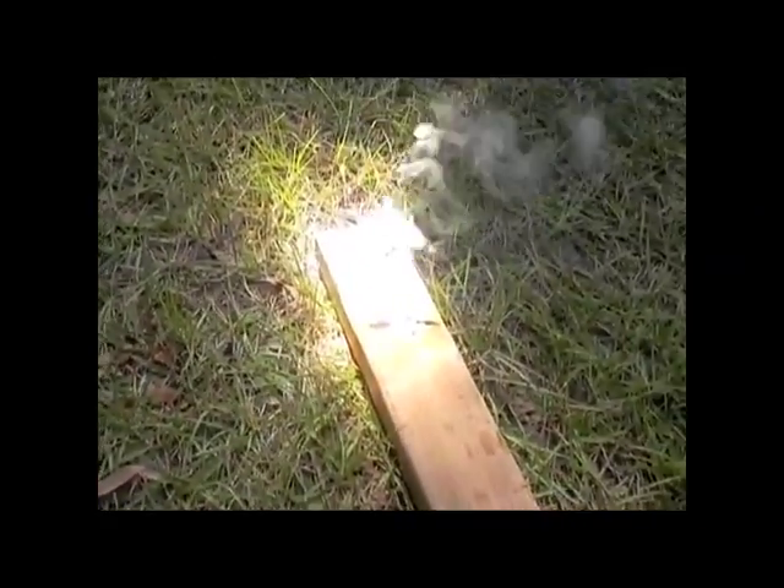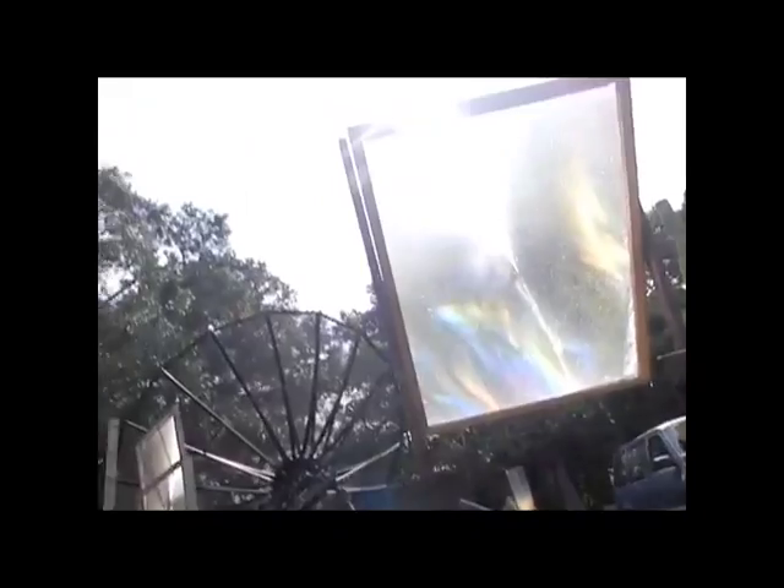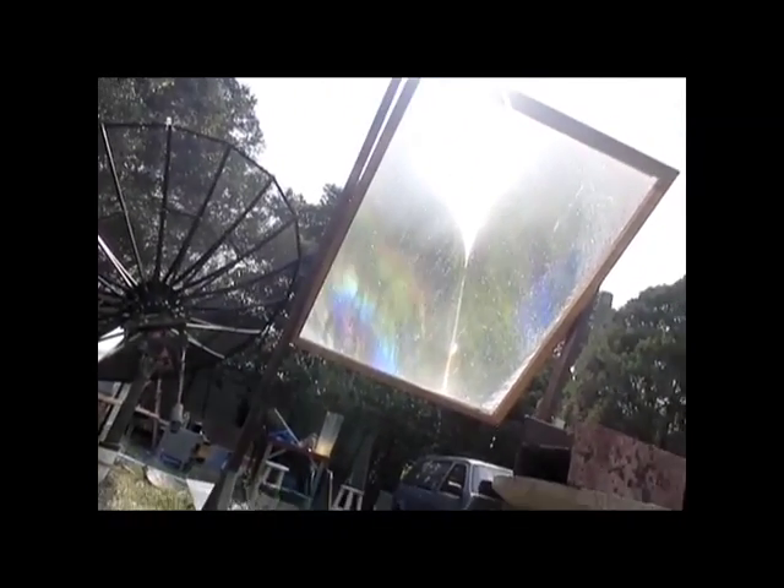You can see that this is actually burning. When this lens dries off, this area will become a safe area again. So if you are doing a solar project where your Fresnel lens is going to be out exposed to the elements, consider that the focal length will double while it's wet.